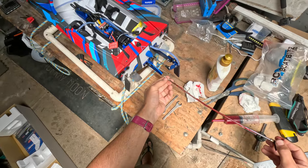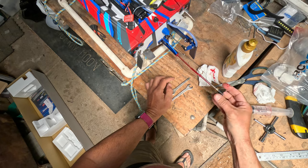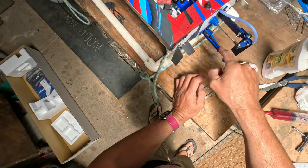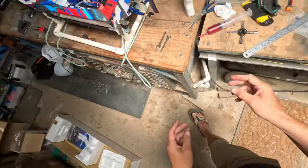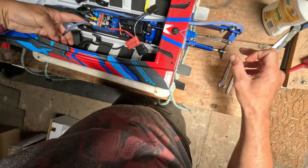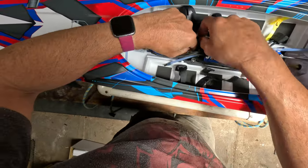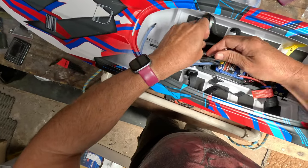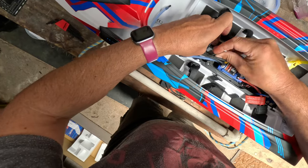Try not to get too much grease on the cable end because that can make it slip in the collet. There's plenty of room to get the grease around it and through the hole. It's quite warm today and that actually shot out a lot more than I thought it was going to — making a real mess. The Teflon liner has slid up, just keep that back. That's about the gap you want — roughly the gap when the boat was new. Don't push it all up so there's no gap; you need to allow for shrinking under load. The cable isn't solid, it's a wound wire, and it will get shorter as soon as you put some load through it — it'll wind up and break your cable. That's why you have your gap.